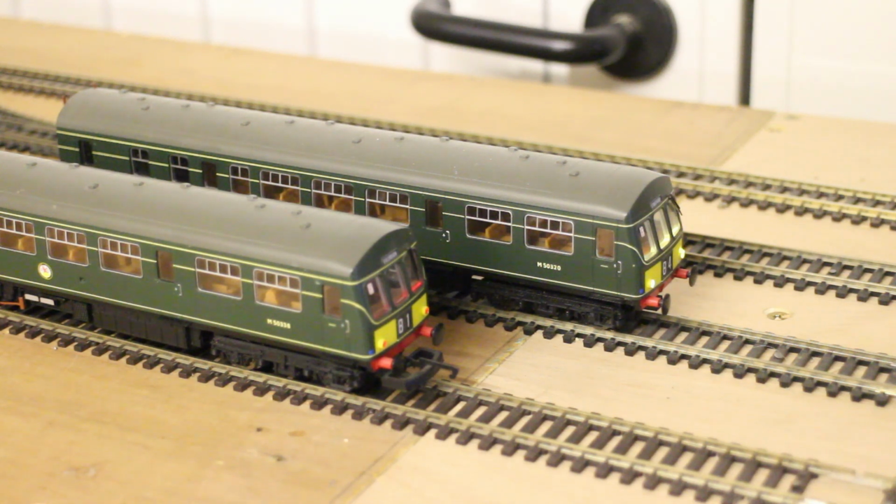Something to note: because this is a regular locomotive decoder, programming it would require a load. If you've ever noticed when you program your locomotive, it jerks on certain controllers, especially the one I have, the DR5000 Digikeijs one. That's basically acknowledging the request. It's the easiest way to do it, but to do that it has to have an actual motor to load. There isn't one on this.